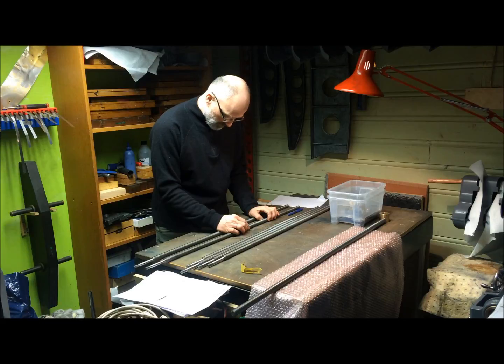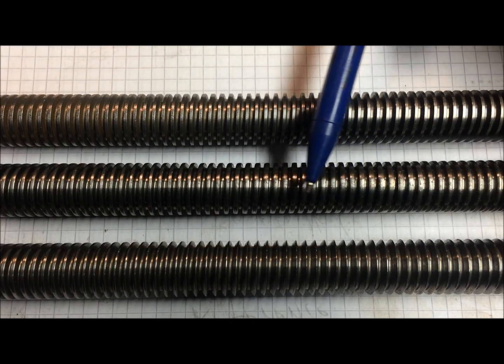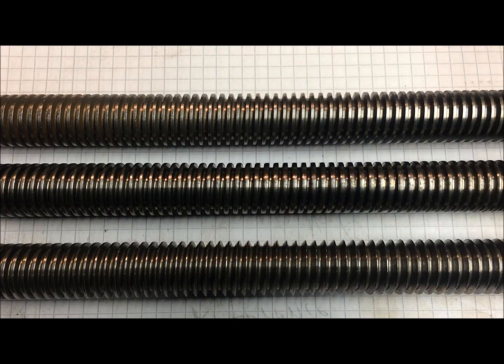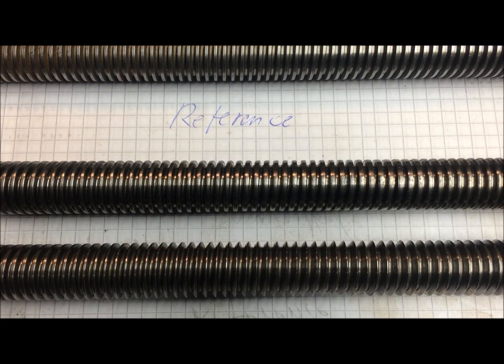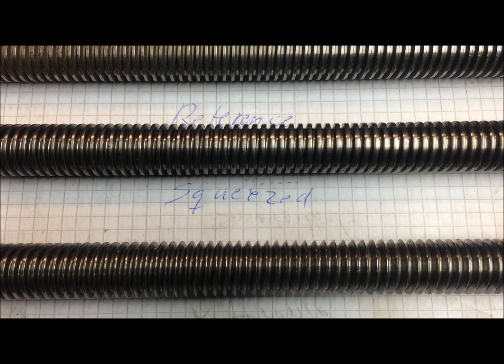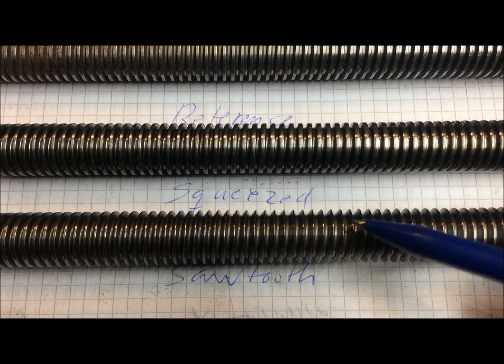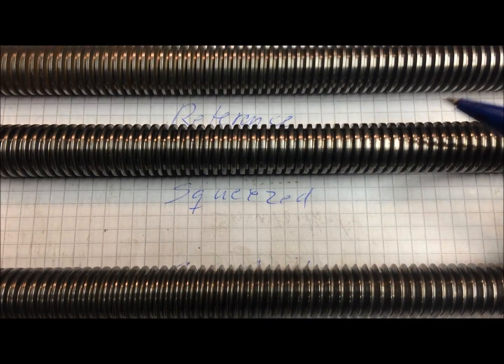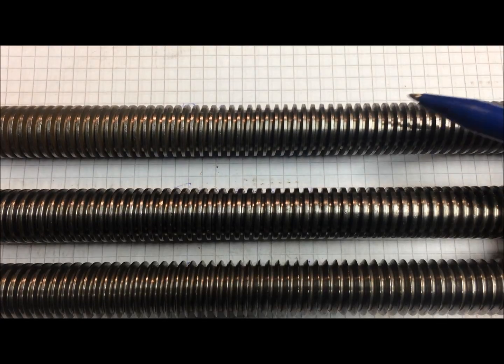It actually is kind of squeezed out. So here we have three screws — this is the point of most wear, but if we take this as reference, we can see that this is the nominal. These threads here are squeezed, and on this one are sawtoothed. So, this being the reference — okay. This being the squeezed — not okay. And neither are these sawtoothed forms, so clearly not okay. And these are kind of squeezed; you can see that probably over here, while this is the nominal one.